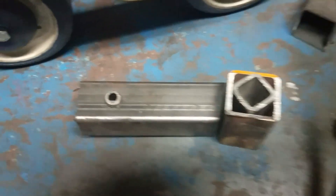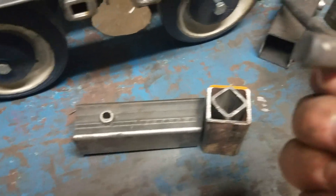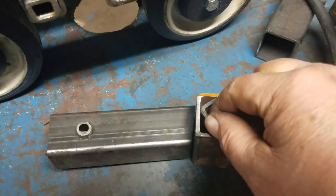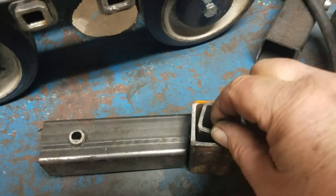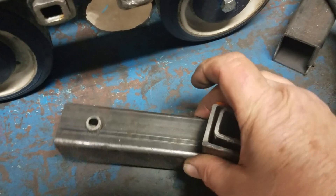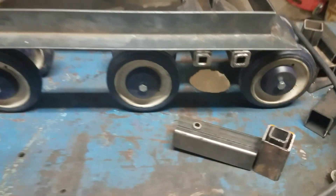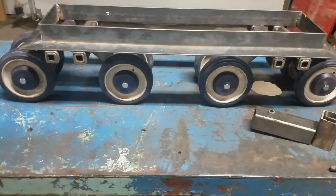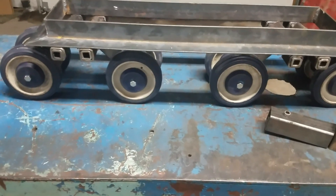You don't want to use tubing — it has to be solid rubber cord. This is 3/8ths. When it's pressed in there with a vise, this moves just a little bit, and thus the whole arm moves a little bit. Each one of these four suspension arms with dual bogie wheels will have its own independent suspension.